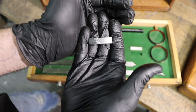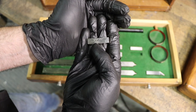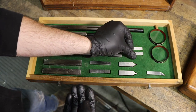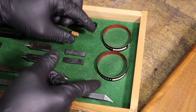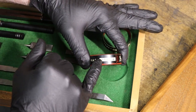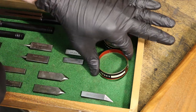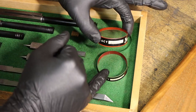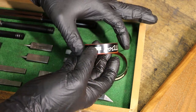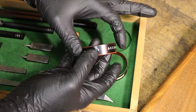What would you use this gauge for? It has a plus and a minus and an accuracy of .00001 inch. Let me show you these awesome optical flats. These optical flats are used to gauge the flatness of an item — this one has a known accuracy of .00002 inch. That's pretty accurate. And then this one is twice as accurate as the first one: .00001 inch. Really nice. Check out the labeling around that — dual optical flat. We'll try one of these out in just a second.